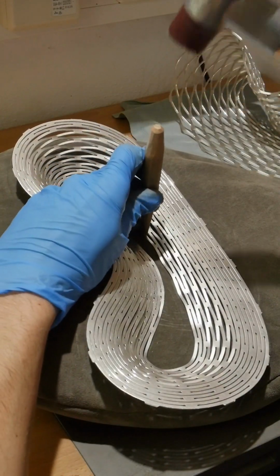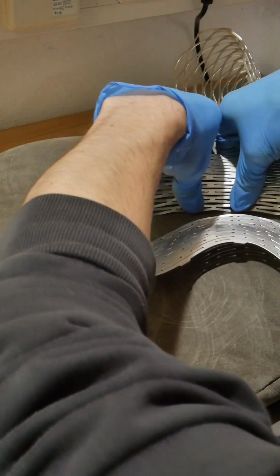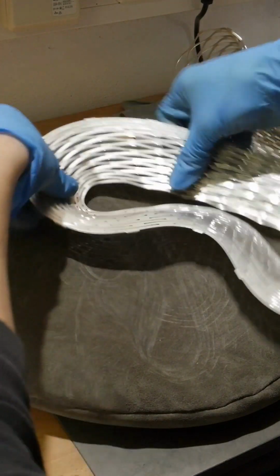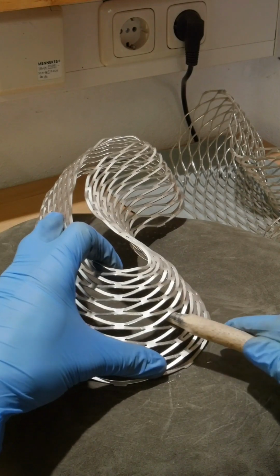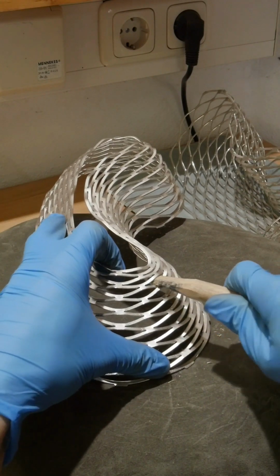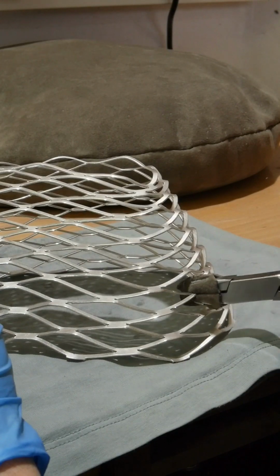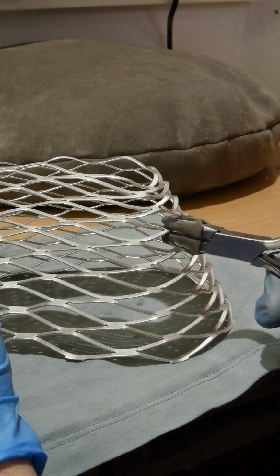I used a combination of a wooden punch on a leather sandbag and just my hands to stretch out the silver. Also turning the flat tip of this wooden dowel worked great to enlarge the spacing. You see me wearing gloves all the time, so I don't leave oxidized fingerprints on the already matte finished surfaces. I also use mainly wooden tools or wrap the tips of these pliers in leather, so I don't leave any scratch marks.